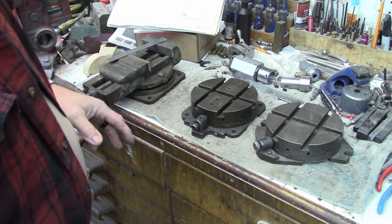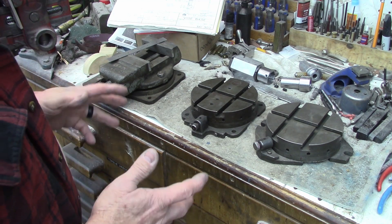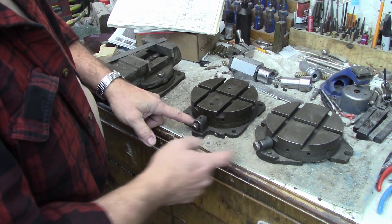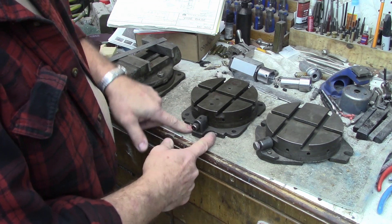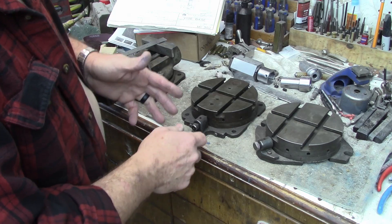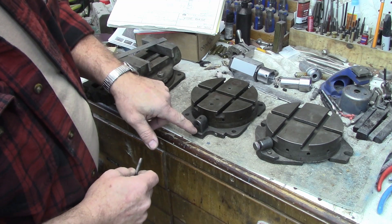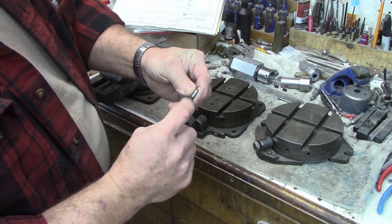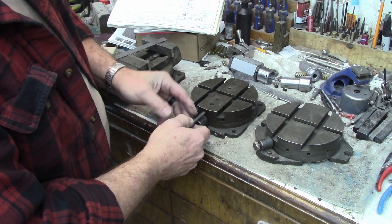One thing I did notice as a difference: on the shaper's rotary table they've got different mountings for the index points. Both of these castings — this one screws on from the front on the rotary table, and this one screws on from the top. Internally they're a little bit different. This is the original one and it's missing the detent, but it would have a detent spring and a ball down in the middle, and it will index on this cutout on the flat here — so it will either index in or pop out to that position to unlock so you can rotate it.